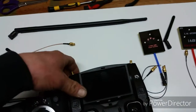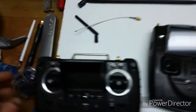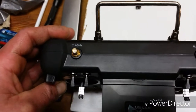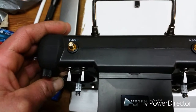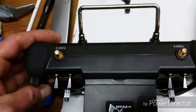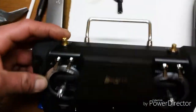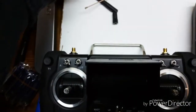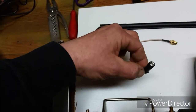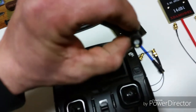Most kits like this come with the regular male SMAs where they have inner needles on both sides. If you look at the advanced transmitter, it has a regular male SMA for the 5.8, but if you look at the 2.4, it is an RP — reverse polarity male SMA. Don't let reverse polarity fool you. It has nothing to do with the electronics. All it has to do with is the gender of where the pin is located — it's either on the SMA connector or on the antenna. This one has the inner hole, while the regular ones have the needle sticking out of the antenna.